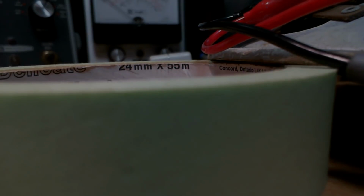Yeah, let's look at the top of my radio here. Let's see if I can get one that's kind of in the clear. Well, there really aren't any in the clear. So if you look at this one, I'm sorry it's dark, but you can see that down at the bottom is a nut right up against the chassis. And then above it is a sleeve, and the sleeve you can see is shaped to receive a tool. So that sleeve above the nut needs to be backed off slightly, and I'll show you in this photo exactly how this works. So we'll flip over to a photo here.